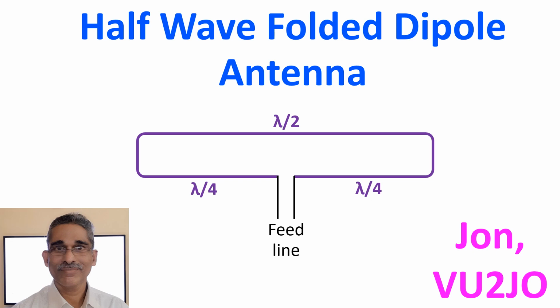Viewing from a homebrewer's aspect, it is technically more difficult to make folded dipole antennas as you have to bend the aluminium tubings usually used for such antennas at right angles twice on both sides. Hence, I am yet to venture into homebrewing of a folded dipole antenna.